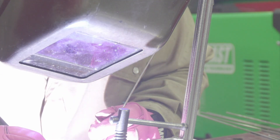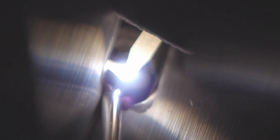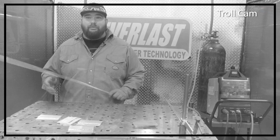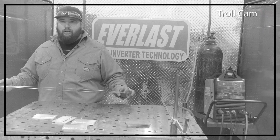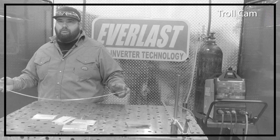Keep that in mind when you do your fabrications, and plan out your weld configurations. You should try to keep aluminum into a fillet weld, lap joint, or T-joint. Try to avoid butt welds as much as possible because they are weak, and more times than not it will crack under load. If you refer to D17 Aerospace, they're going to have preferred ways to weld aluminum. You're going to be tested on butt welds, but they try to engineer fillets for strength.